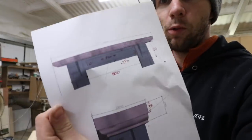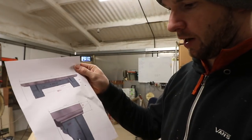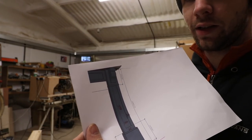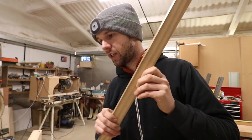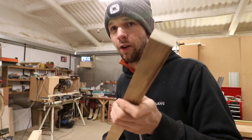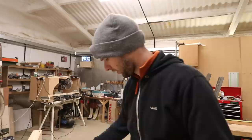It's exactly the same principle with the top of the mantelpiece. So just a small shaker frame, slightly different dimension pieces, but this section of the frame, I don't know if you can see it anywhere there, look, is actually narrower than the uprights, so it's a slightly less thickness. So one of the pieces that I've got out is that thickness of the material by the sight line that you see, so it saves me again adding a piece onto the back, and then the top piece haven't quite got enough of that material to make the full width, but it doesn't matter because you don't see it. So this will just be set back and grooved the same 12mm of the other piece, and it will look like a square sort of flush face frame from the front.